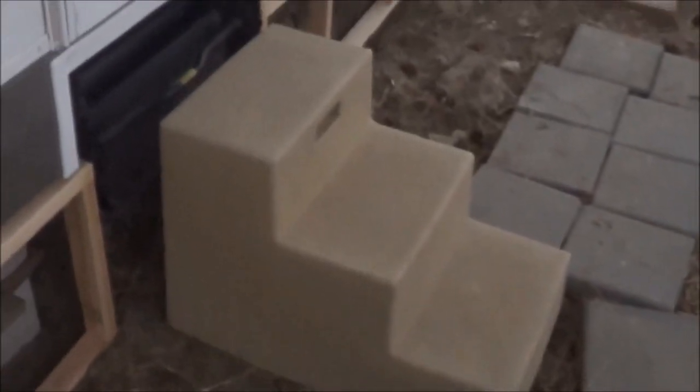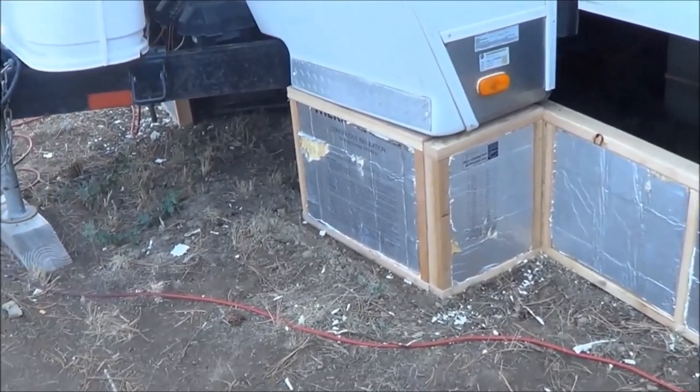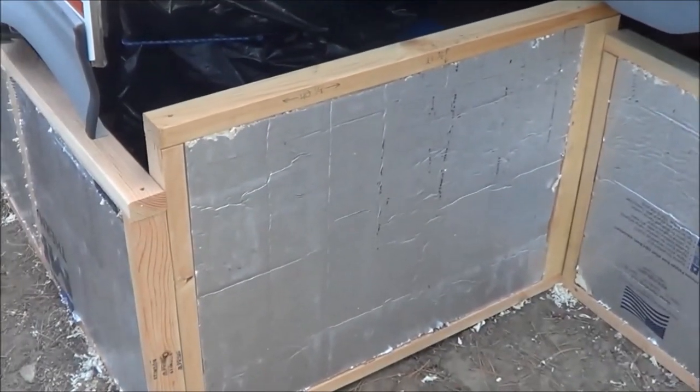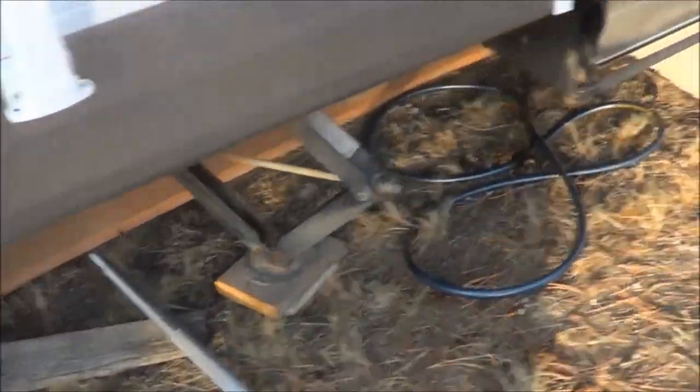There's going to be a bunch of little access doors — that part's not done. It's just easier to skirt so I don't have to skirt around the steps. Sealed them in, pretty snug but not too snug. It's two-inch insulated foam board with foil backing on both sides, cut to fit real snug. Those little openings will be doors, and there's a door up in the top part there. Got to fill this corner — ran out of wood.